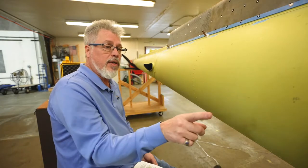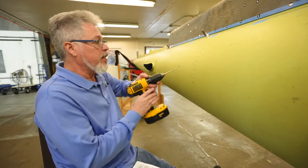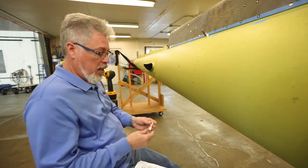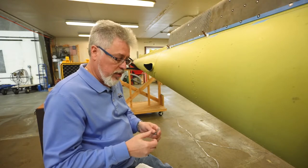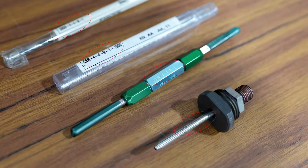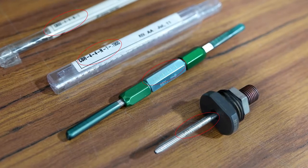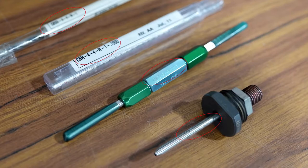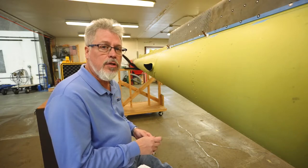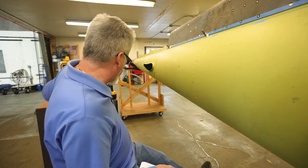So the strakes have been lined up, and you remove this rivet as an attach point. The first step is to get the starting reamer that's in the kit. What I want to emphasize here is that these reamers and drills have numbers on them — CBR, CBSR, 4-2, or whatever the case may be. Make sure that the numbers correspond between the tube and the drill itself. We try our best to make sure there's no confusion, but just double-check. It's a good practice so there are no mix-ups during the installation steps.